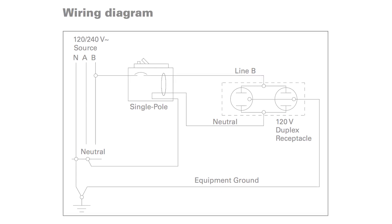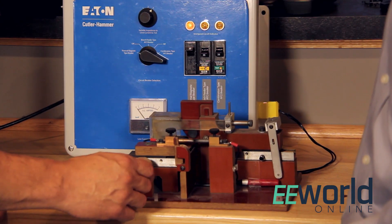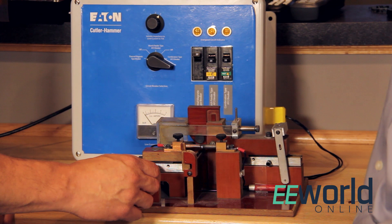I'm going to show you what happens when you have a normal circuit breaker. This is a normal circuit breaker that we call a thermomagnetic breaker, and it basically works on the properties of a bi-metallic strip. If a bi-metallic strip sees too much current, the metals separate because they heat at different rates. So when that happens, a normal breaker would trip if you have a fault. But in this case we're creating something called an arcing fault.